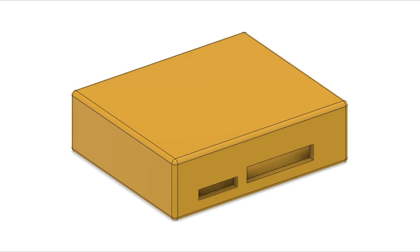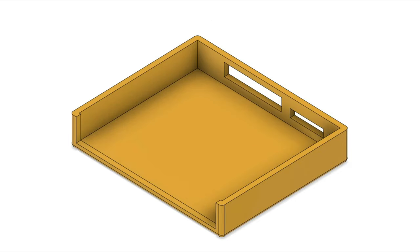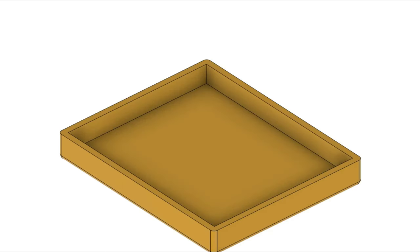We'll also create a slot so we can see the LEDs, although I'm sure they'll shine through the plastic in any case. We'll split the case in half so we have a way to get the TapeCart inside, and also to allow us to print the case with the top and bottom flat on the print bed. Supports are put in place to hold the bottom of the PCB away from the bottom of the case, so there's no stress placed on any of the lower solder joints. For the top of the case, we need to add in some pillars, which will act as a pressure fit for the two halves of the case, and also to stop the PCB from moving around inside.